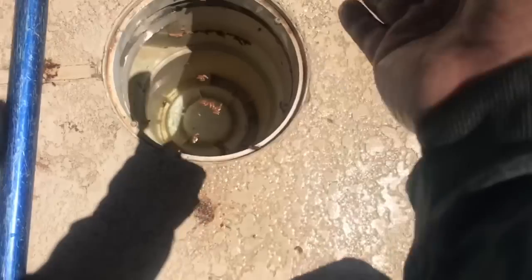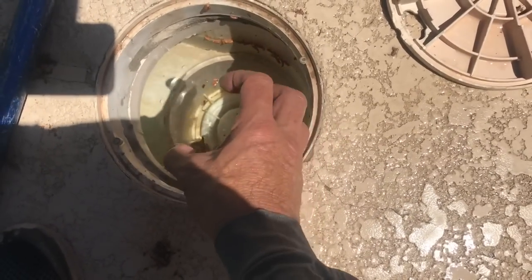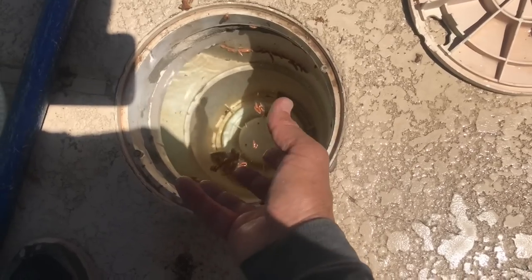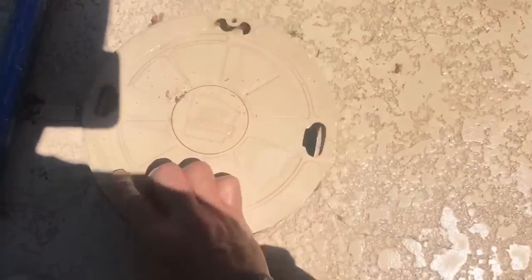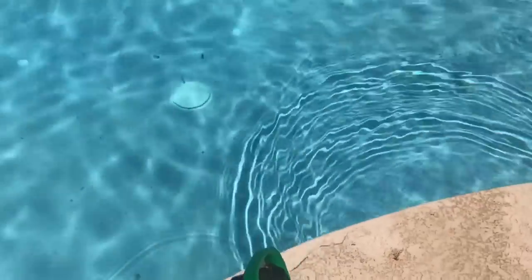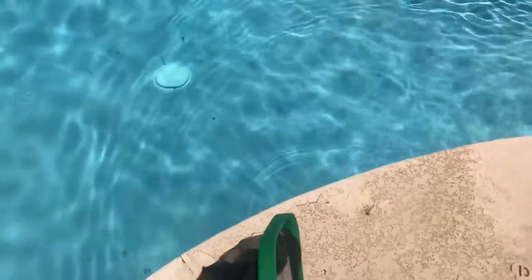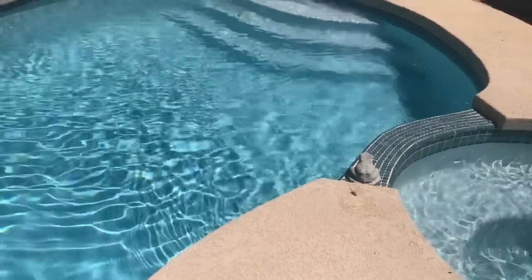What I've found is that little float, a lot of times, doesn't float very well — for whatever reason it gets old, cracks, and sticks down there, and then your skimmer doesn't work very well. Most of my pools have auto fillers, so that's usually not an issue, but it is something to consider. This pool does have a diverter, and I've taken them out of a lot of my pools.